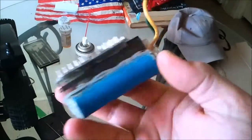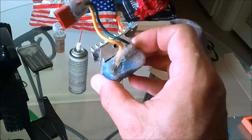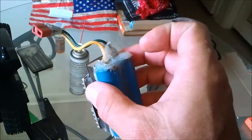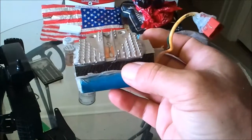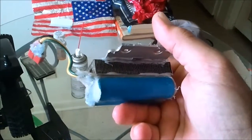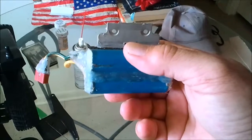Another thing I could do to help cool down this battery is to add two more cells and make it a two-cell 7.4V pack with two cells in parallel. It would also double my milliamp hours from 2500 — which I've been charging up to 2400 successfully and repeatedly — bringing it up to a 5000 milliamp hour battery. I think that's what I'm going to do; these seem to be good batteries for RCs.